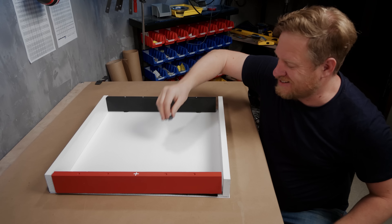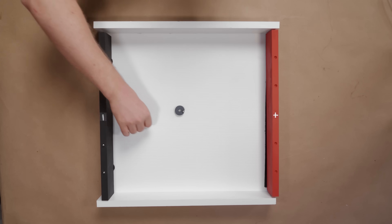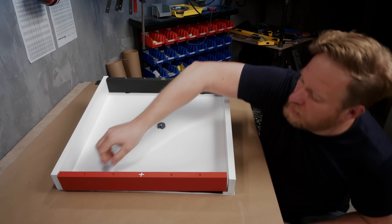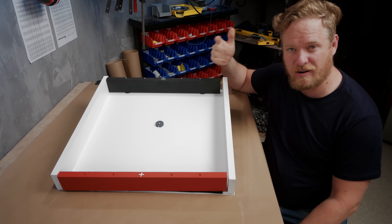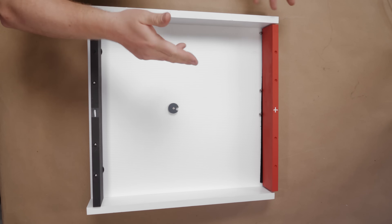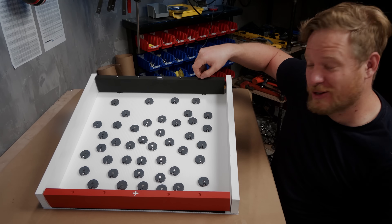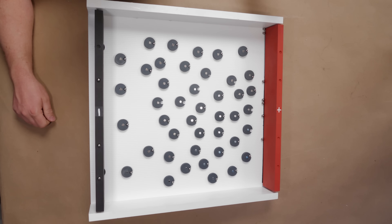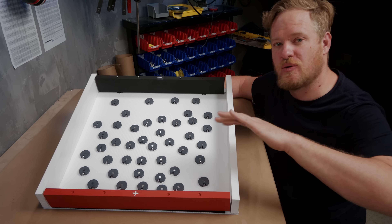This represents a gas atom — we'll say it's nitrogen because we're talking about air. This is an electron in orbit around that atom, and the atom really doesn't want to let go of it. However, if an electron hits it hard enough, that electron can get popped out of orbit. Now let's put it together and talk about how electric arcs happen. A nitrogen atom is floating between our two electrodes. Something hits the negative electrode — like an x-ray or a photon — and causes one of these electrons to get popped off. It gets pulled down towards the positive electrode, and if it hits our nitrogen atom, it can pop an electron out of orbit. Now one free-floating electron has become two. When we have a whole lot of nitrogen atoms with their own electrons, it causes a cascade effect that multiplies — this is called Townsend Discharge, or perhaps more aptly, a Townsend Avalanche. One free electron turns into two, which turns into four, and so on, creating a flow of electrons between the two electrodes, which is the electrical arc.